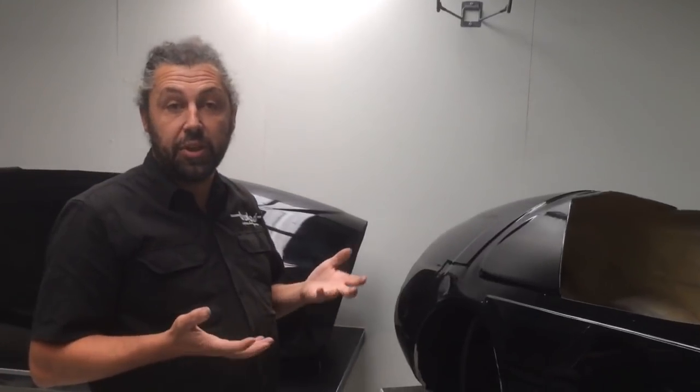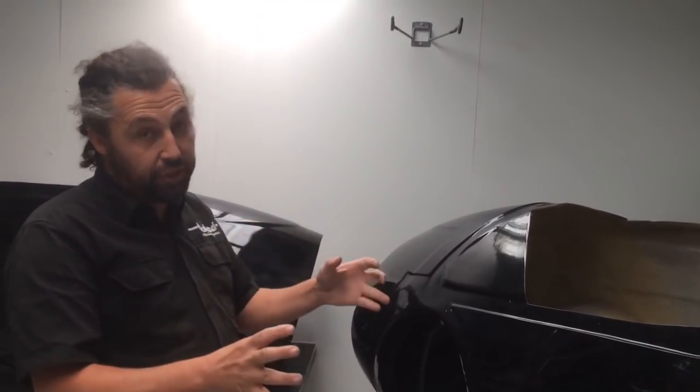This was really successful and we were really happy with this. It meant that the nose cone could regularly be replaced and is bonded on, which means we could use that as a little bit of crumple zone. We could actually change the composite makeup of the nose cone versus the shell, so that it could absorb the bigger impacts with barriers when riders really make big mistakes.